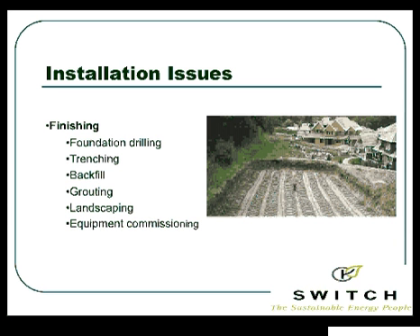You have to do a proper design and put this in properly because you're going to affect things around the septic. You wouldn't want to freeze your septic system up because you're drawing too much heat out of the ground at that point. So that's where proper design comes in. I can have that field as half the field, but that means I've concentrated pulling energy from one spot and I'm going to maybe cause a problem in that spot. We have to spread that out so we use the energy over a wide area, or we have to dig deep enough.